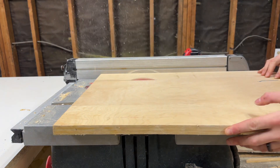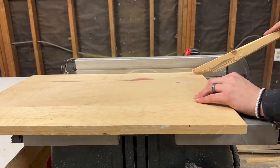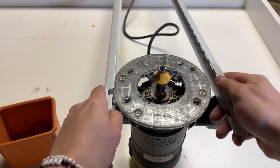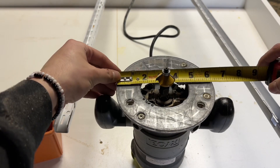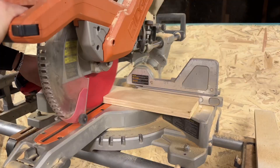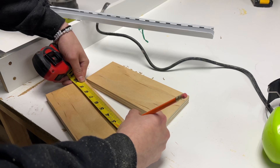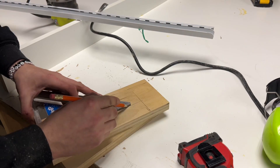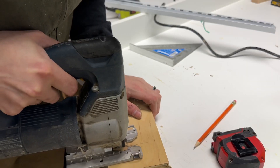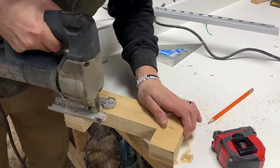Now that my box is assembled, I'm going to the table saw with that scrap plywood and cutting a rip about four or five inches tall. It needs to be tall enough to accept the track I'm using and deep enough for the router bit. I'll measure the base plate of my router, add about four inches, and cut that length from the rips. Then I lay out a notch on these boards the width of the router base plate, screw them together so I only have to cut once, then cut the notch with my jigsaw.